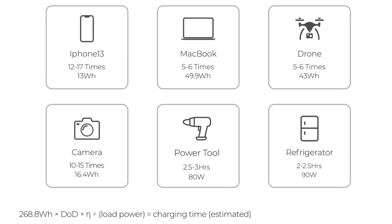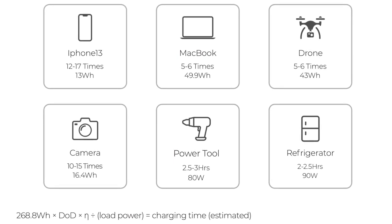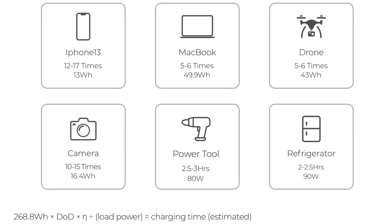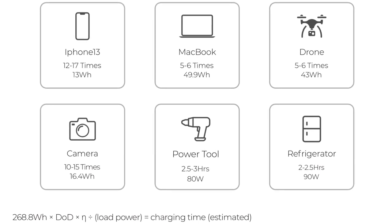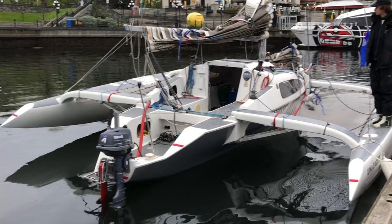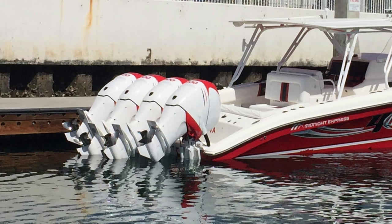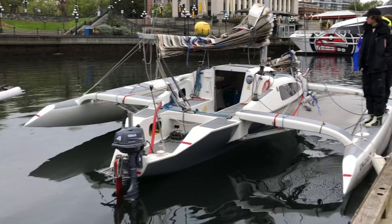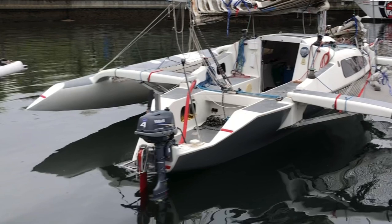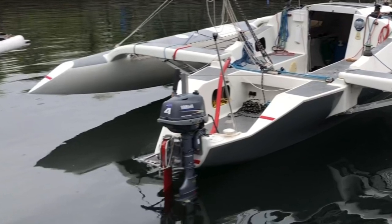The EB3A has a 268-watt-hour lithium iron phosphate battery, which is enough capacity to charge common items several times or run them for a few hours. This is about the same usable capacity as a Group U1 lead acid battery, or about 25 amp hours at 12 volts. Bluetti measures the output in watt hours because all the outputs have different voltages, so amp hours would be meaningless. The EB3A is one of Bluetti's smallest units, which is exactly what I need for my lightweight day sailor, but you can get larger units and connect them together to meet pretty much any power requirements. With only 10 amps of DC output in a single connector, the EB3A doesn't provide enough power to start an outboard, but if I needed to do that, I would just get a small Group U1 lead acid starting battery and use the EB3A for my house loads, charging it through the 12-volt input from the alternator output.